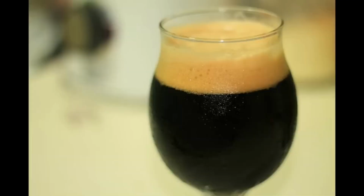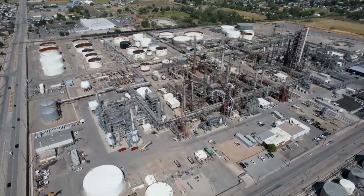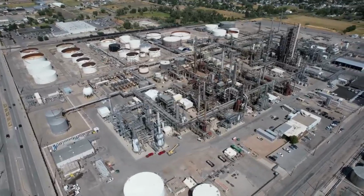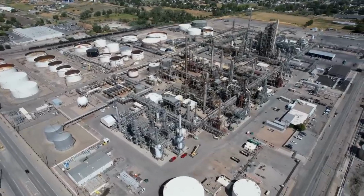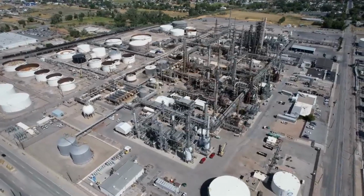What's really exciting about this process is that unlike the way plastics are produced today, the process is low energy and doesn't require the use of toxic chemicals. The best chemists in the world could not convert polyethylene into spider silk, but these bacteria can. What they're really doing is harnessing what nature has developed to do manufacturing for us. After 72 hours, you strain off the bacteria, freeze dry it, and what you end up with is a material that looks like torn up cotton balls, and that's ready to spin into a silk thread.